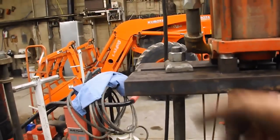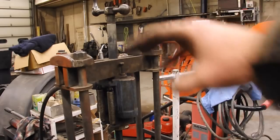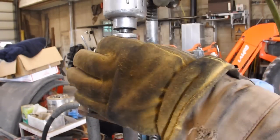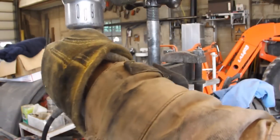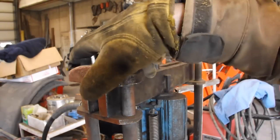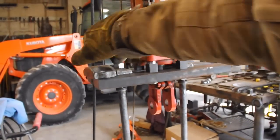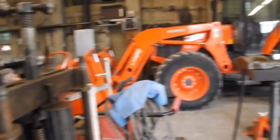And then I will drill a couple holes up here that match this hole pattern, so I can bolt it on the top of this thing if I want to use it here in the shop. That means I can even use these caps for transfer punching — set them on there and transfer punch. That way the width will be right, just got to get this length right.